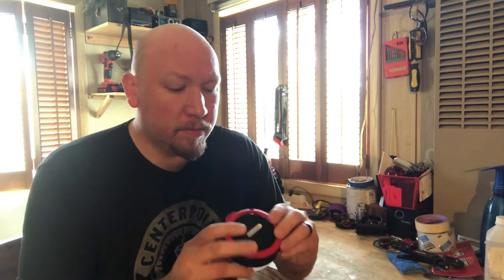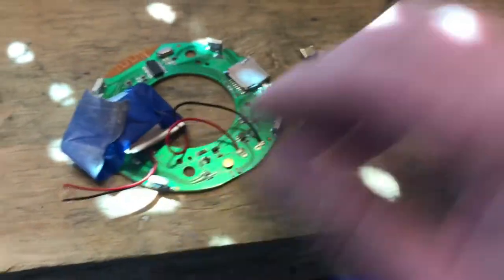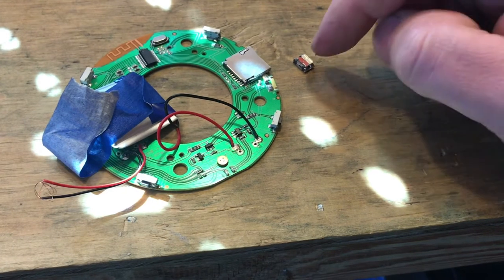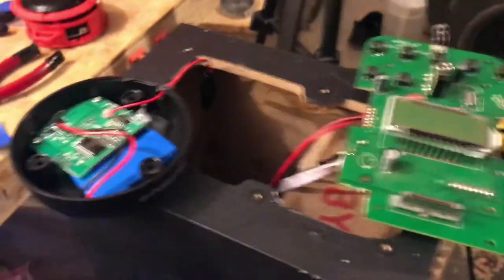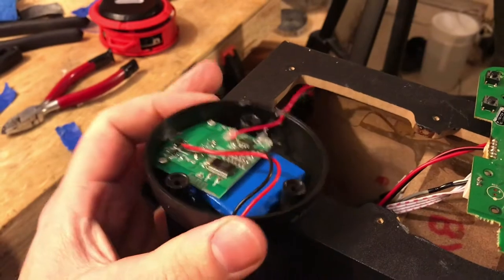But as soon as I plugged it in for this first charge, the charging port broke off. Unable to fix this port, I had to take another look at the original Bluetooth and found that by simply soldering one of the audio out wires to a different part of the board, it was able to work perfectly. Okay, so here it is, somewhat cleaned up. I put the board back where it originally went.